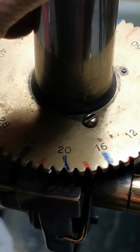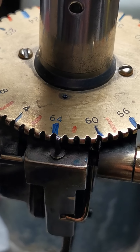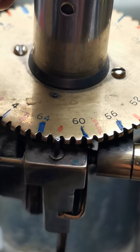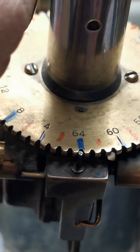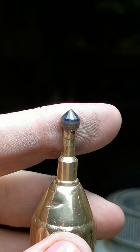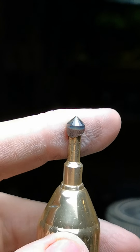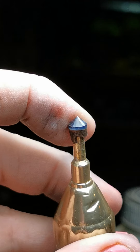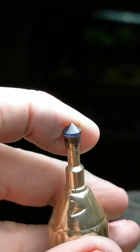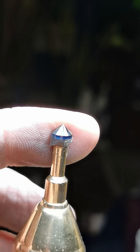I'm cutting on a 64 index — you may be using a 96 — so I've got my mains at the blue positions: 64, 48, etc., and the breaks or girdle facets at the red positions: 62, 2, 6, etc. Now I'm going to polish everything: first polish the girdle, then the breaks, then the mains. Some of the breaks are a bit overcut, so when I polish the mains I'll make sure I polish them down until they nicely meet the girdle.